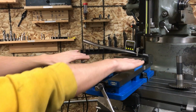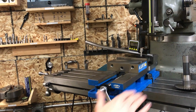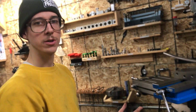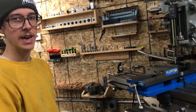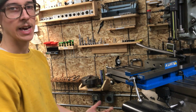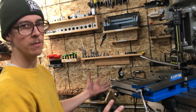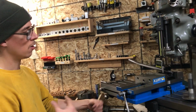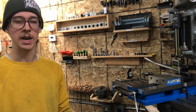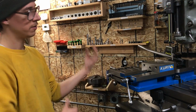And in order to know what you want that inside face of your chainstay or seat stay angle to be, you need to draw that up, full scale drawing on paper, or you could model it in 2D or 3D CAD software. Or what I always did in the past was I would use bike CAD software, which I already had. It's maybe not the most sophisticated for modeling the rear end of a bike with ovalizations and tapers and multiple bends and things, but you can certainly get the job done well enough for this.